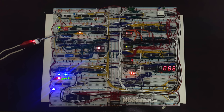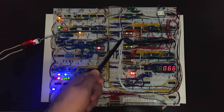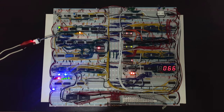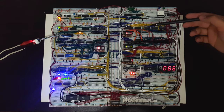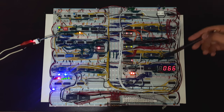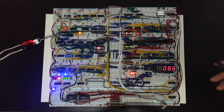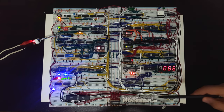This is the microcode. It sends different control signals to the rest of the computer. Remember in the previous videos we had a load-A signal — it was a wire for the A register which had 'load A' on it, or maybe 'clear A' or 'reload B' or the SUB signal for the ALU which made it subtract. We don't really have those individual wires anymore because they're all connected down here to these control signals.